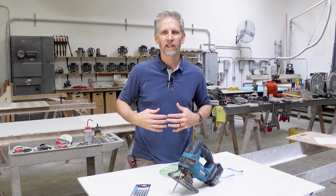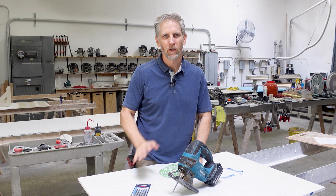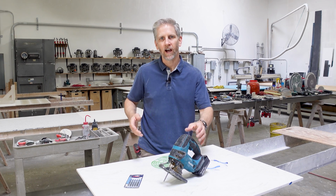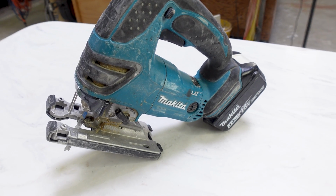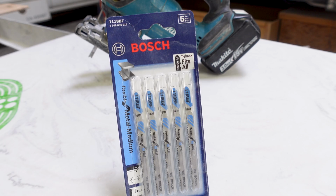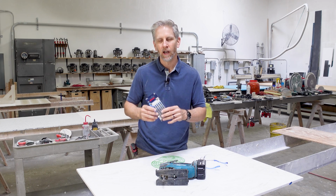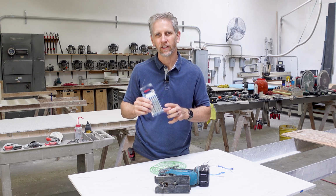Welcome. My name is Andy, and in this video I'm going to show you how to cut solid surface material with a jigsaw. The first thing you're going to obviously need is a jigsaw, but the most important thing is a jigsaw blade. Now, these blades are made for cutting metal, but they work great for cutting Corian solid surface material. I'm going to leave a link to this product in the description below.